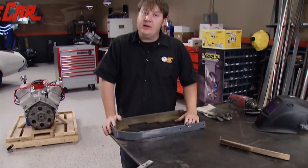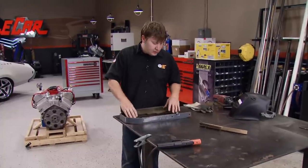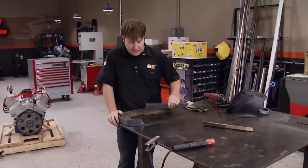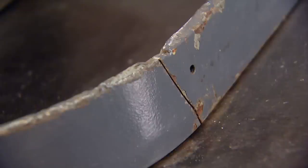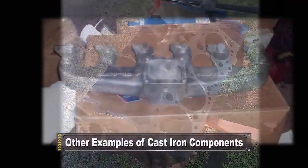Hey y'all, we've got a little repair that we've got to do today in the shop, and a couple of you at home have sent us some emails regarding this type of thing. This is an old top to a drill press and it's seen its better days because it's broken in half. You're probably just sitting at home going, I'll just weld it and move on. Well, the problem is that this thing is made of cast iron and normal welding techniques have a tendency not to work.